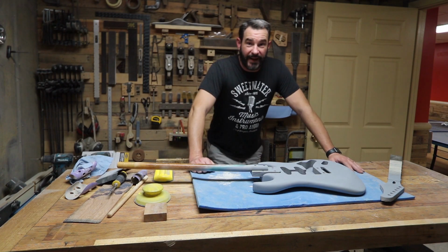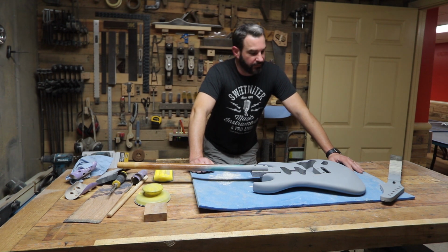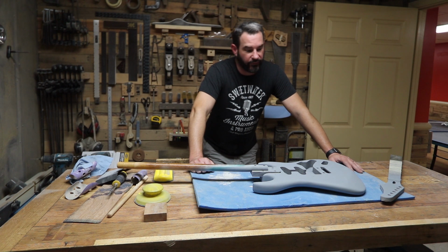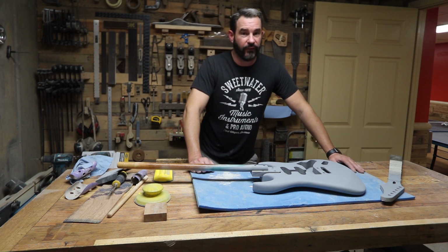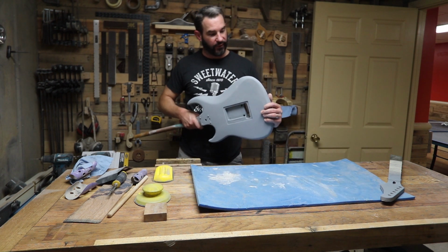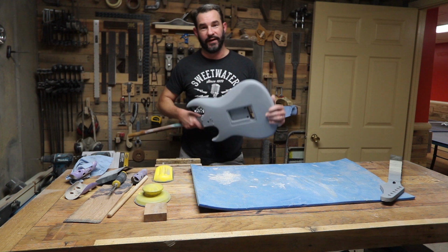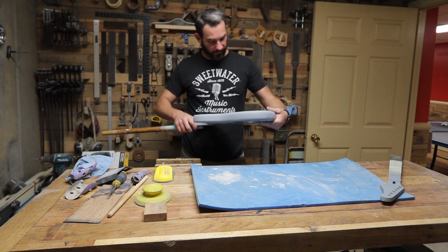All right, I'm finally back in the shop working on this plywood Strat again. It's been a long process of trial and error, bad luck with spray nozzle tips, and sanding back too far in between coats to level things off, and trying to really attack all the grain filling that needed to be done in this plywood. So before I shoot any color on this, I want to make sure I cannot see any of the plies on the edge grain, on the end grain, or anywhere else.